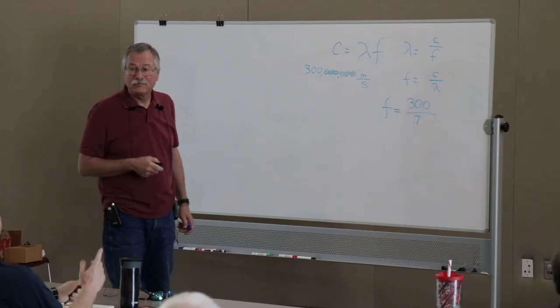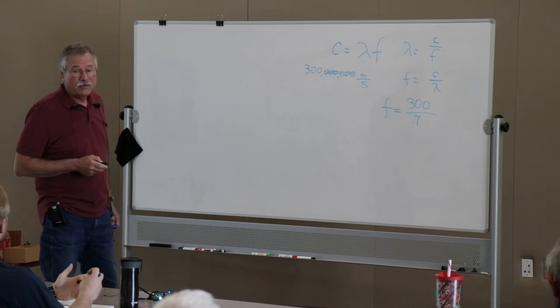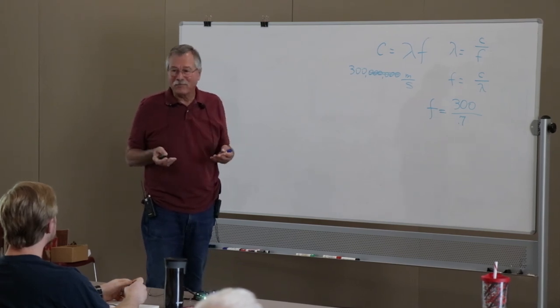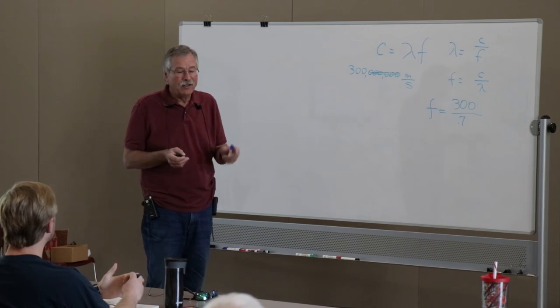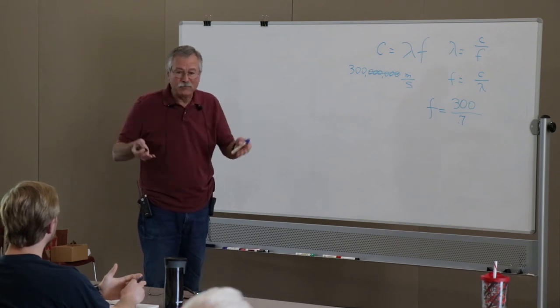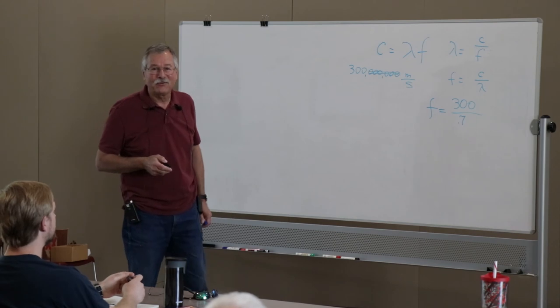The modulation for commercial video broadcast is AM, called vestigial sideband. So if you were to tune in the original analog channel 2 on an old TV set, you would be essentially receiving something similar to single sideband on the video. Today, everything is being done digitally, so you can kind of forget those theories.